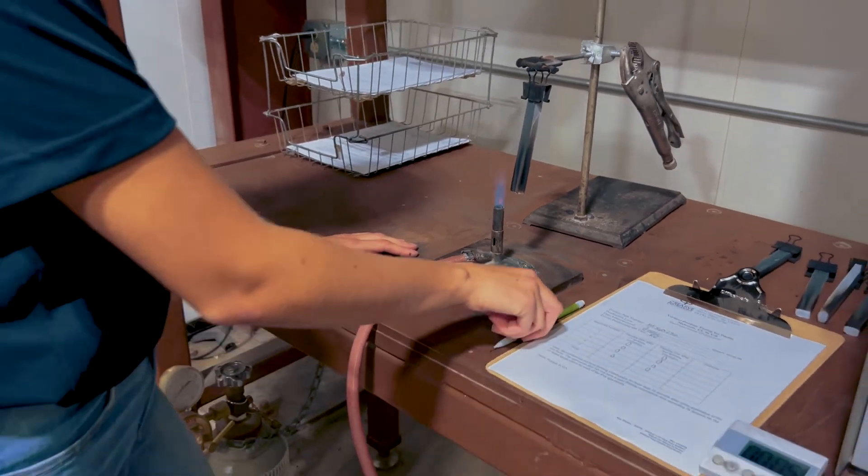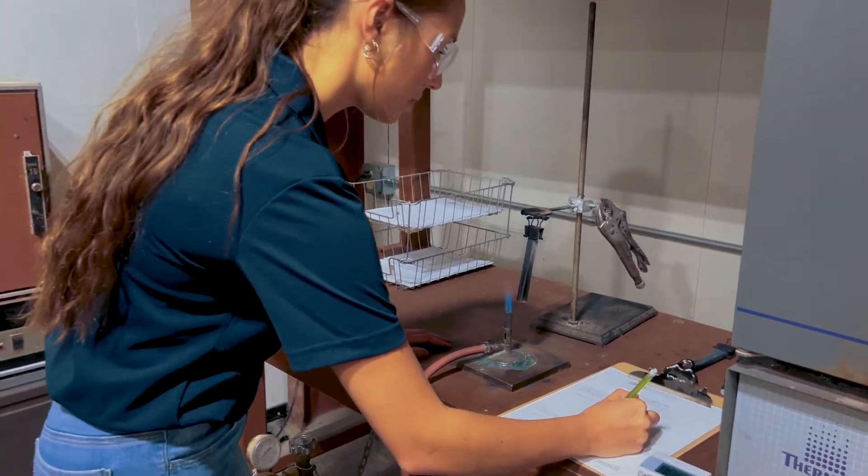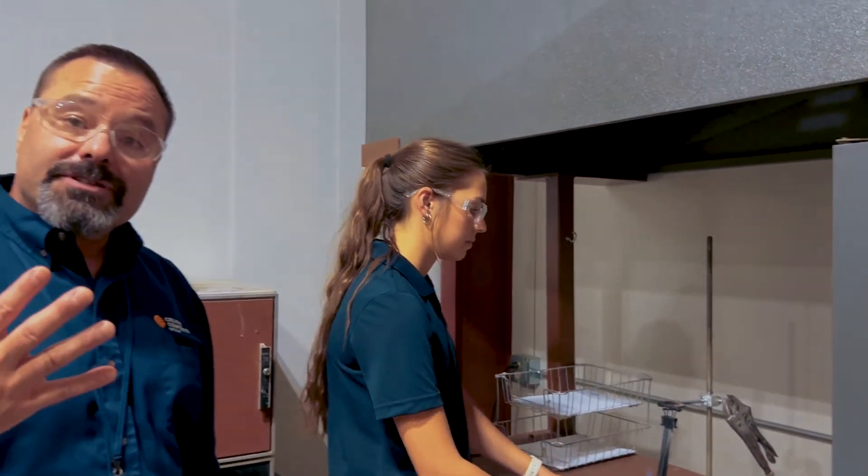It was a total time of 20 seconds per sample. Kelsey's going to test five different samples out of the same profile. Five samples were extracted from the profile — one has to be on the edge of the profile, and the other one's from the interior. The total time of burn cannot exceed 50 seconds. You noted from the test that it self-extinguished instantly. So this profile passed UL-94 with a V0 rating, which means production is clear to continue manufacturing the profile.